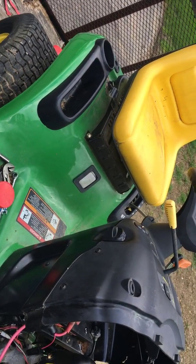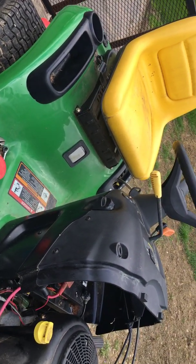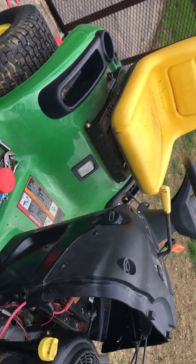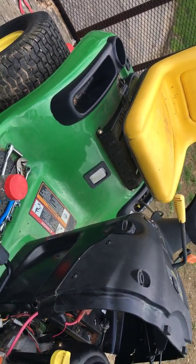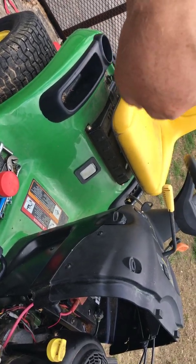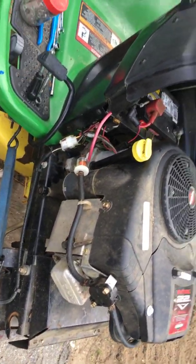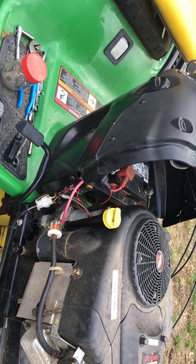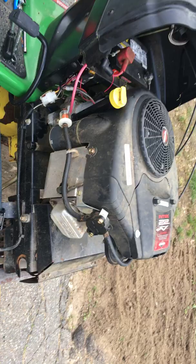I liked using the blower in the gas tank. You put a little pressure in it. I didn't have my air hose out here, and I didn't want to go connect two hoses. So I said, hey, let me try my BG86 Stihl handheld blower. I put a little pressure into that outlet. It pressurized that tank. Fuel came squirting out. I got rid of it all. It beats having to vacuum or suck all the fuel out by hand. So just a tip for you guys. Hopefully someone can use it.